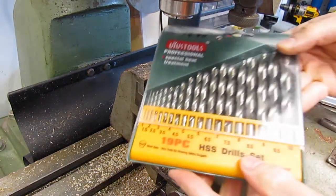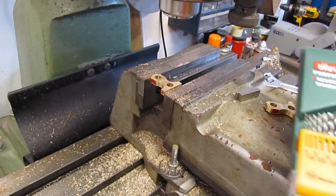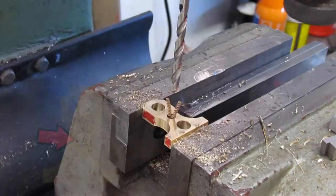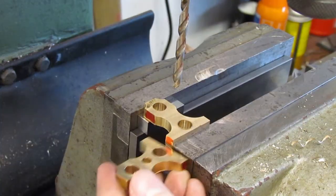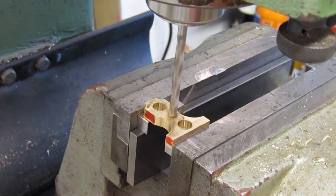Back in December 2011, when visiting my wife's family in South America, one of my brother-in-laws gifted me a metric drill set. Nothing of high quality, but it has been a very handy set of tools. The reason the drill slipped in the first part is due to using a fractional collet to hold a metric drill — not always the best thing to do.